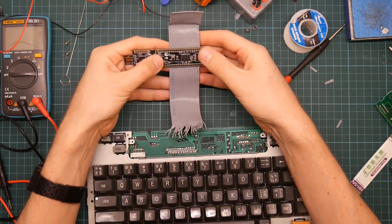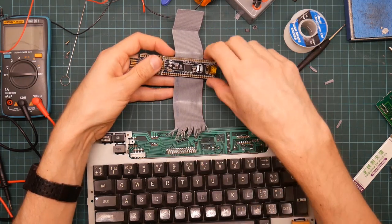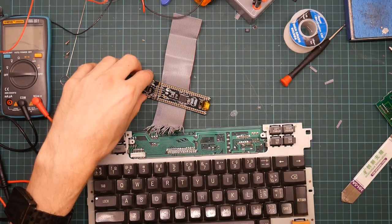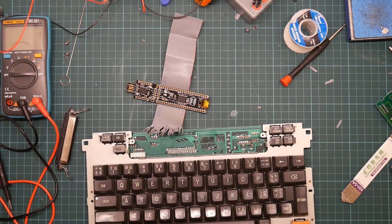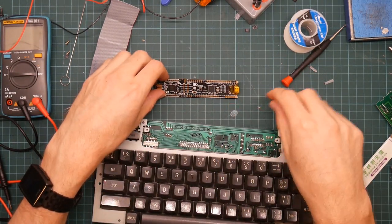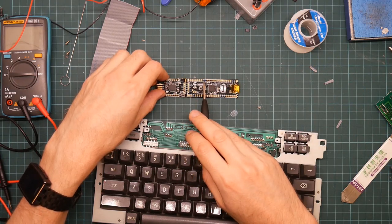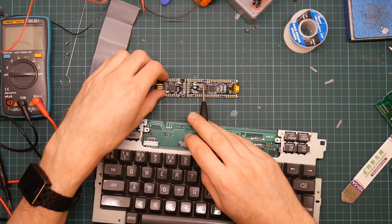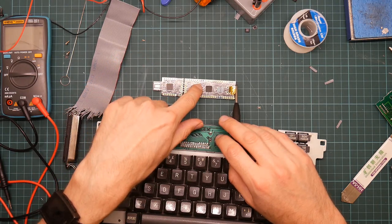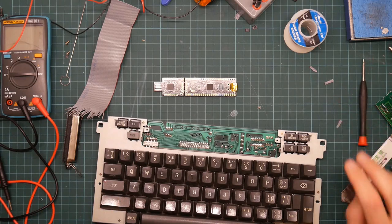And the other thing I need to do is to go through the pins on the board and figure out the dedicated ones. So in fact, I will go and do that now. Okay, that's done. I've blacked out the pins I don't want to use. The ones on the bottom have capacitors attached to them. And these two at the top are for programming the device. And these two here, this one is wired up to the switch, which is nominally useful, and this one is wired up to the LED, which is also nominally useful.